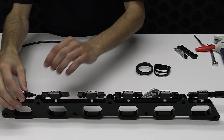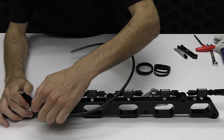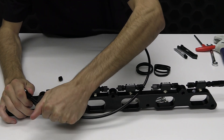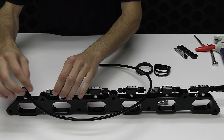Assemble the nylon rail. Remove two quick connect nuts on the far left and put them on the nylon tubing, one facing each quick connect fitting. Slide the tubing into the far left fitting, tighten the nut down, then measure, mark, and cut it where the next quick connect fitting is. Repeat until you get to the last quick connect fitting and the rail is complete.